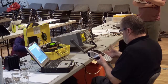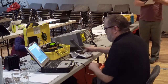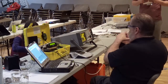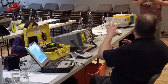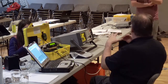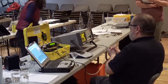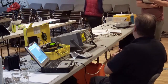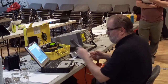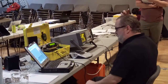Now the important thing, why do we label it? A couple of things there. That radio and TNC now is a matched pair. If he changed the radio out, we'd have to retest it, because it might have different levels, the impedance might be different, the drive levels are different, the inputs are possibly different, so it can be considerably different for many reasons. So there you go, Steve, we'll get you to put that on when we're finished there.